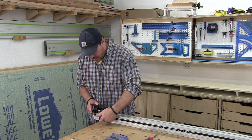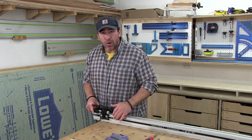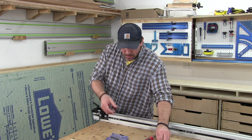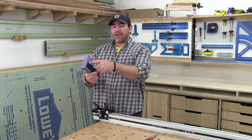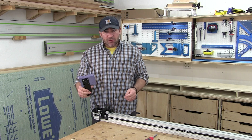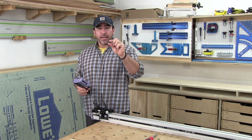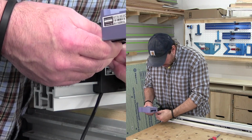Okay, so now my little clip, the guide clip, is engaged into the pin, and so when I move everything, the encoder slides along the electronic scale. Now I could take the digital readout. The bracket on the digital readout is already installed for you when you receive it, and you use the 1/4-20 shoulder bolts to attach it to the back.